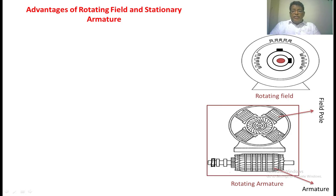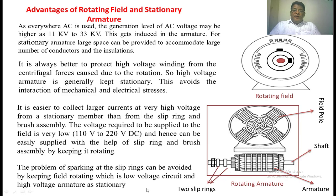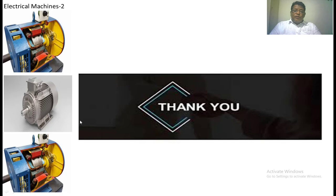Here is the construction where we are using armature winding on the rotor. If we keep the armature winding on the rotor, then it requires three slip rings. The field is stationary and it is a projected field winding. Moreover, if we keep the high voltage winding on the rotor, a large amount of sparking will also be produced between the slip rings. These are the different advantages of the rotating field and stationary armature arrangement. This type of construction — where the field is stationary and armature rotates — is used for low power ratings. But in power plants such as hydro and thermal power plants, we use the rotating field type construction because they generate power at 11 kV and 33 kV, which is very high voltage. So we have to keep the armature winding as the stationary part. Thank you very much. If you have any doubt, you can ask me directly or in the comment box — I am always welcome.